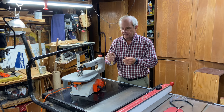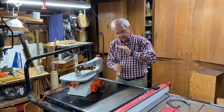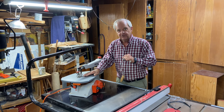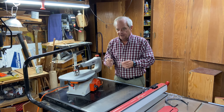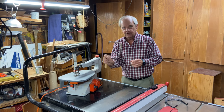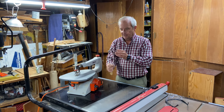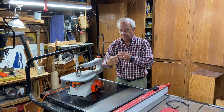The key difference between using the scroll saw and the coping saw to make a curved cut: on the scroll saw, you turn the material, not the blade. On the coping saw, you have to turn the blade in order to make the curve. You do an up and down motion, keeping the geometry of the blade strictly perpendicular as you turn it and go through the material.